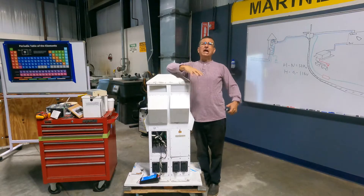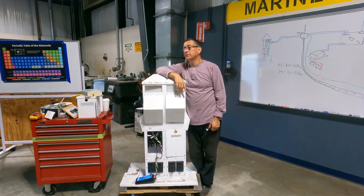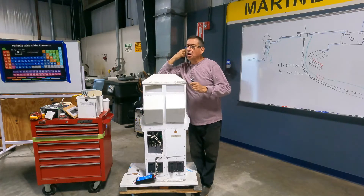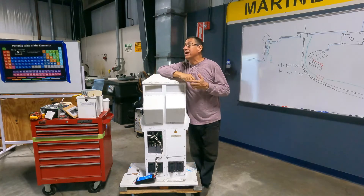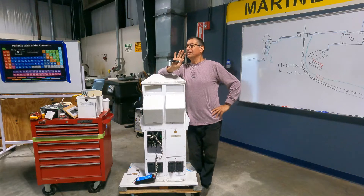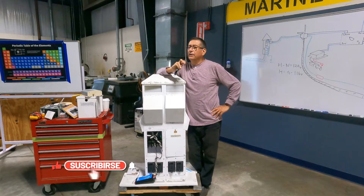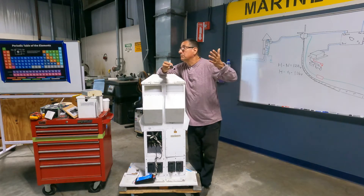Hey, mister manager of the marina, your ground is not good. 120 and 115 - five volts difference, that's not good. Take pictures, call the ABYC, and they close the marina within 24 hours. That can destroy the boat - that's millions. Two volts or more, finito. The ground is a critical part - through the ground enters the contamination.